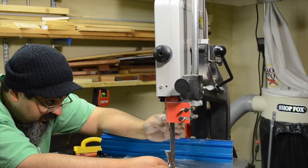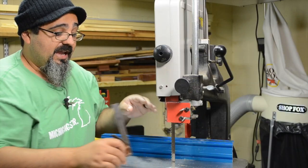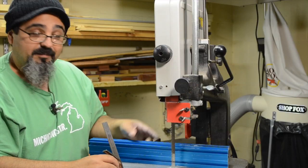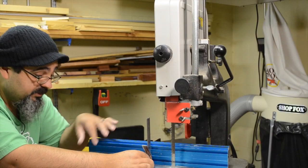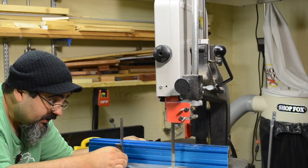Since I'm going to be using this fence as my guide, I'm going to be running the stock right up against it, so I'll simply clamp it into place. It doesn't have to be in any particular place. I'm going to check it for 90 degrees because with this particular fence setup — and with most of them — you can make an adjustment. I'll check it at a couple of different points, especially near the blade. All right, it's all set up.